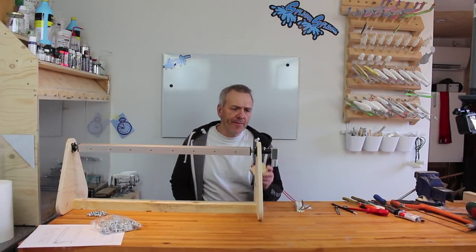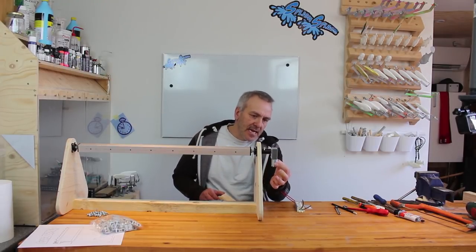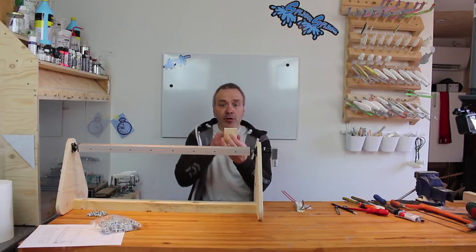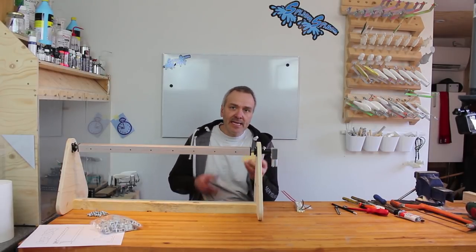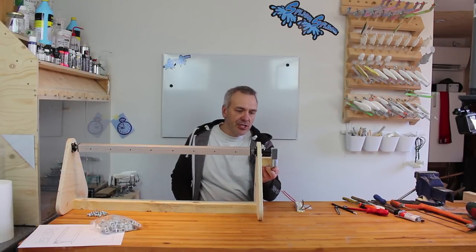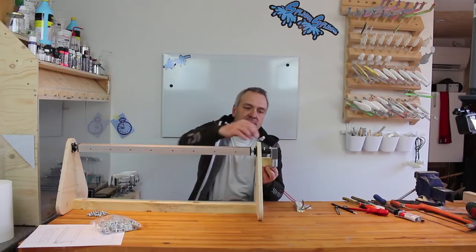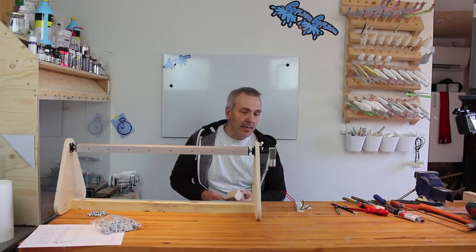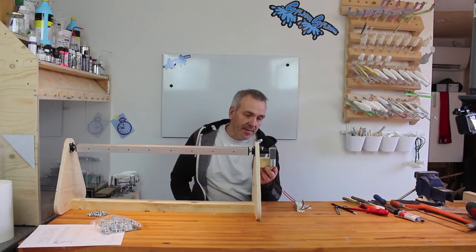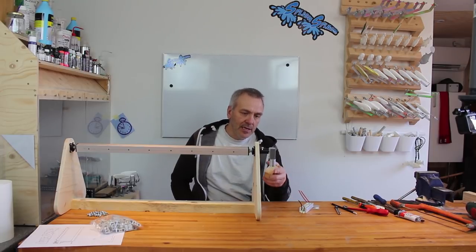I will now make the holder for the motor here, and the way to do it is, I have this little block of wood here, and I will drill a hole through it that is the same diameter as the motor itself, and then I will cut down on each side to have a U-shaped hole, which will be exactly the width of the motor. That way I'll just be able to screw this into the side here and prevent the motor from running around. Still, I can always screw out this screw and pull out the motor and change it if needed. I don't know how long a lifetime these motors have. But that was the idea, and that will also help me as I need to solder on these wires from the power supply onto the motor here.